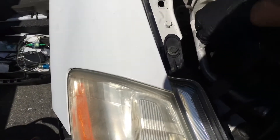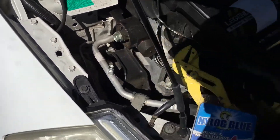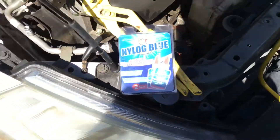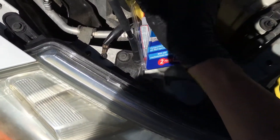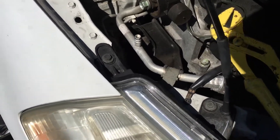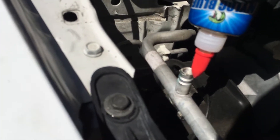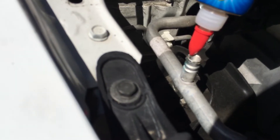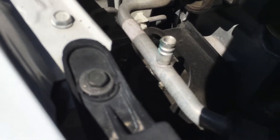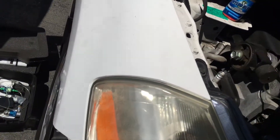The fittings are really dry and a little dusty. When you take off your caps, clean the dust off because dust will damage your o-rings over time. Every couple of applications, re-lubricate your o-rings. Use something like nylog or silicone grease — you don't need much, just a dab will do. I always put too much on when I'm trying to hold the camera. That'll help protect your o-rings and give you a better seal under vacuum.